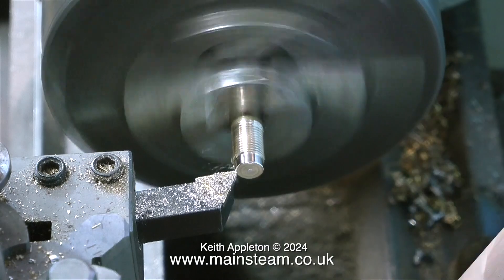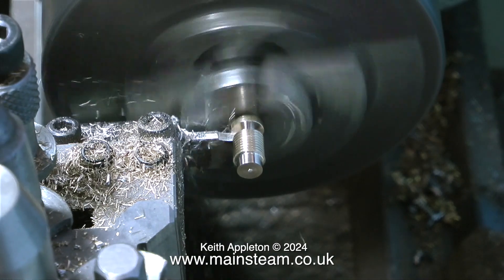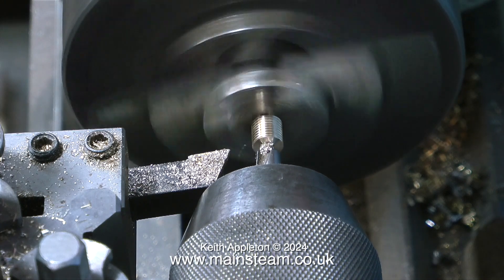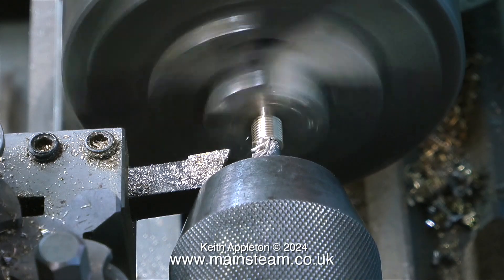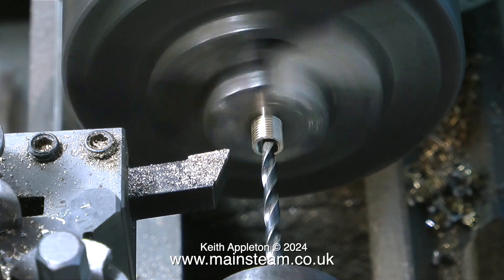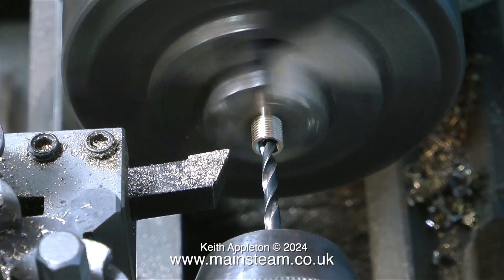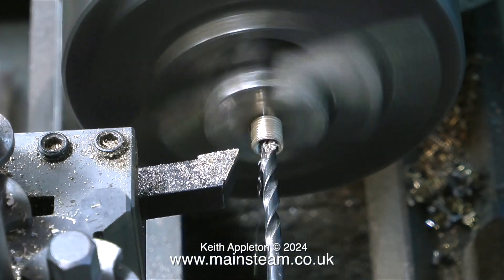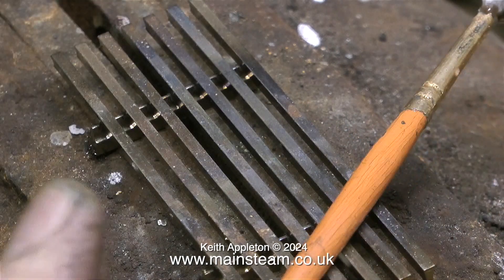That's one done, now time for the other — I hate mass production! I speeded this part up by 400%. I set the parting tool this time using the first part as a guide rather than a union nut. The next part of the sequence is to drill the hole down the centre — this wouldn't be a good union if it didn't have a hole down the centre. I'm using a centre drill first as always, making a deep depression in the end to accept the 60-degree coned union that will be silver soldered onto the end of the pipe. The hole down the centre of this adapter is 5/32 of an inch. I repeat the process on the other piece of brass and eventually end up with two union adapters.